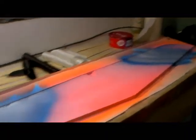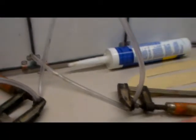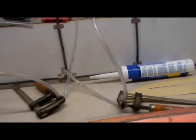I've just painted my wing moulds. They don't look very pretty on this side, but hopefully they'll be right when I take them out of the mould. This is my vacuum pump down here. I've got that hooked up so I can see my vacuum gauge on my wall. I've had it sucked down for a while now. I've got two lines here that come from the pump, I've got them cramped off. The reason why I cramp everything off and leave it sucked down is just to make sure my system hasn't got any leaks in it, so I'm not chasing leaks in my bag when it's actually the system that's leaking. At the moment it's holding pressure, so we'll lay this wing up now.